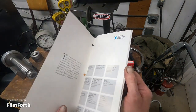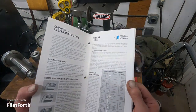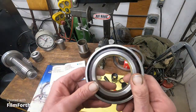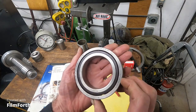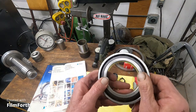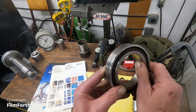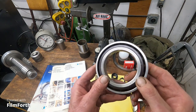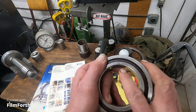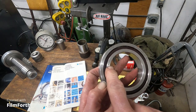I also talk about the cages. This bearing — it's an MRC — is out of a 1969 Hardinge lathe. This is the type used in the chuckers and the HLV-H, a pair of these. Here are the high spots — I'll rotate it around. They're lined up here; here's the high spot on the inner race.